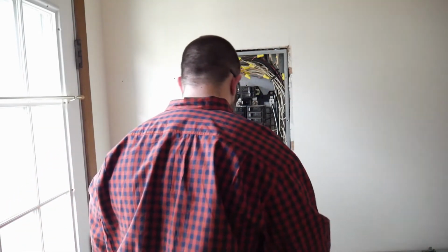Just to update you guys on the conversation I just had, because I cut that out of the footage. There's no need for you guys to listen to that kind of language from my uncle. So it looks like that before the previous owner moved out, they may have unhooked the well from the power. So what I'm doing right now is I am screwing the breaker and the wires back together. Then I'm gonna pop that back in my panel, turn the power back on, and hopefully, if everything goes right, we should be in business. Stand by.